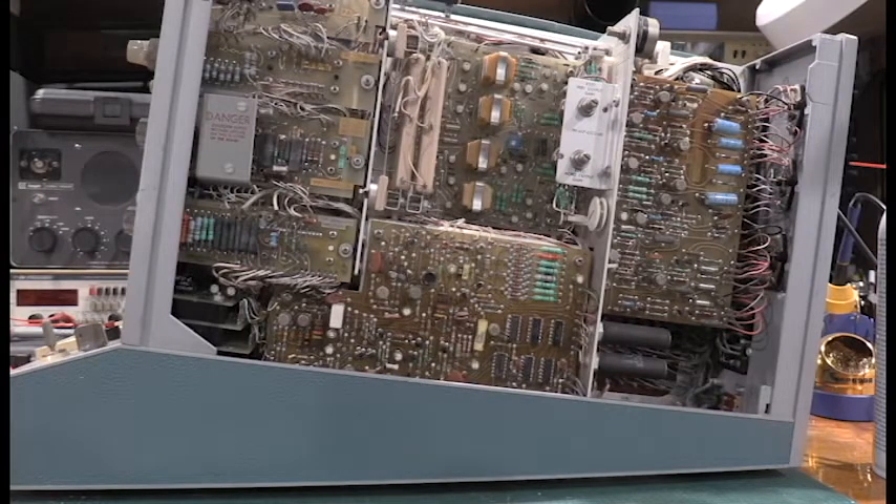I've cleaned all the switches in the front panel. There are a few multi-bank switches that cause some problems in these units, especially the older they get. Ran into some trouble with the controls on the front panel — this particular unit was sold as 'controls needed cleaning,' but what was actually going on was the controls were pretty mushy. I found that half the controls on the front weren't even lined up with where they were supposed to go. I had to take all the knobs off, realign the controls, and one of the controls that's an absolute sore spot with these units did give me a bit of trouble — fortunately it wasn't too bad on this one.